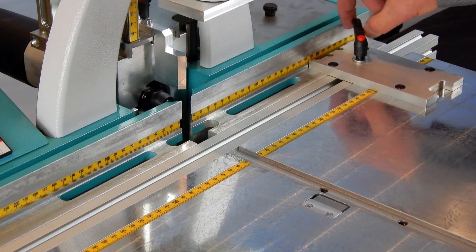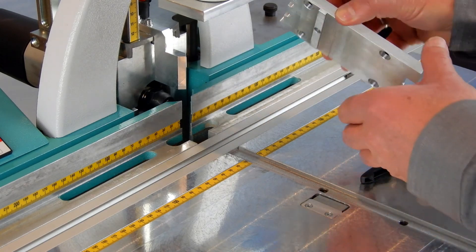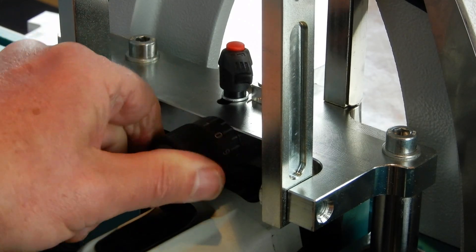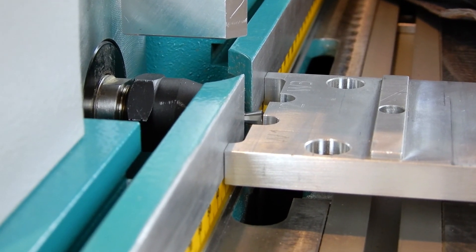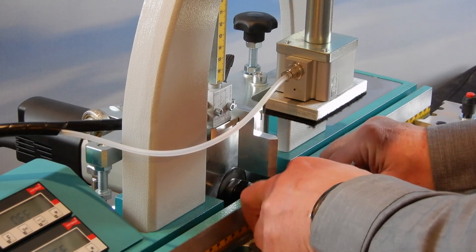Take off the butt stop, flip it over, and use it as a setup jig. By turning the knob on the rear side of the motor plate, you can move the cutter towards or away from the operator.